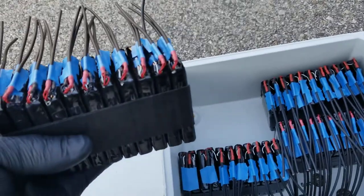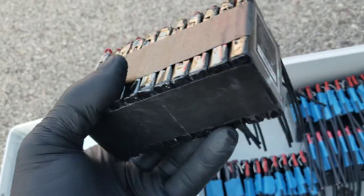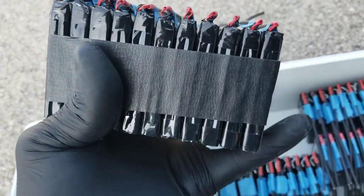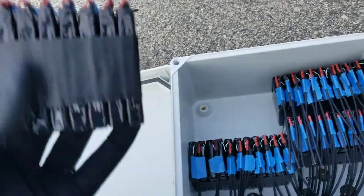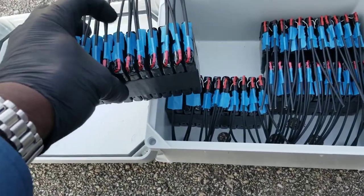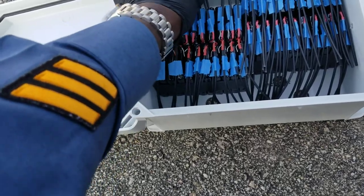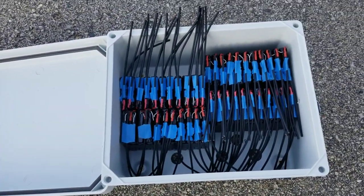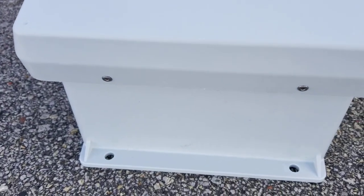We can build 12, 24, 36, or 48 volt configurations. Adding them in 15s gives us 56-point-something volts with 6 amp-hours — that's a 48 volt bank. But we're not trying to use these batteries for high discharge or big loads — these are just for a convenient, portable way to run stuff for DIY. My main idea is having one as a pack, and you can grab it just like a little case for 12 volts, with terminals on the sides just like a jump pack.